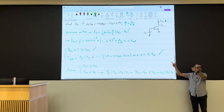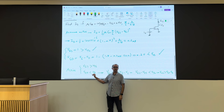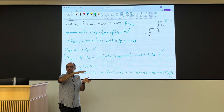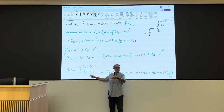But if you're analyzing your circuit, this is, I think, easier. You look at the gate, you're finding all these voltages. So you're finding gate voltage, you're finding drain voltage, you're finding source voltage, and you have one parameter to compare. What is VGD, what is VGS, right? So this voltage, VGS minus VTH, if you look at, for example, Sedra Smith, they call this overdrive voltage. This overdrive voltage means how much beyond VTH I'm pushing VGS. The current and everything else is proportional to that. So if you're designing a circuit, you know the overdrive, so your life is easier if you use this equation. If you're analyzing it, you don't know your overdrive, you're just finding it out. Right? So you're finding out your ID or VGS minus VTH, all those things are calculated. This one, I think, is easier.